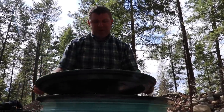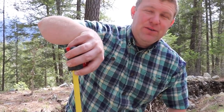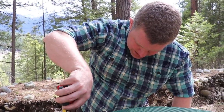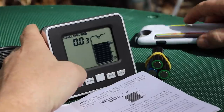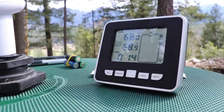This one we actually have to measure the water depth. We're telling it two measurements: how far away is the lowest point it will measure — what empty is — and how far full is. The answer is 88 inches for the low water mark from here. Our tank depth is 7.33 feet and the air gap is 40 inches. It looks like it has a reading and it's saying the tank is full. I think it updates every 30 seconds if the fluid level changes, or every 3 minutes if it hasn't changed, to conserve power.